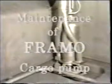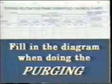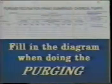Preventive maintenance of the FRAMO cargo pump. The most important check on a FRAMO submerged cargo pump is purging the pump's cofferdam. Always remember to purge the cofferdam before and after using the cargo pump. Fill in the purging routine diagram when the pump is purged.